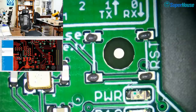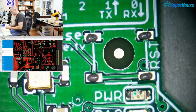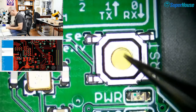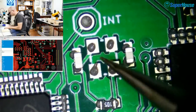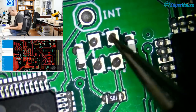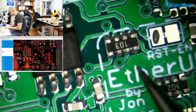I'm just going to grab a surface mount button out of my parts cabinet stuck on the wall over there and stick the reset switch on there. Okay, so this here that you can see, there's no crystal on there. That's because I don't actually have any 25 megahertz crystals in that footprint. So I'm going to bodge an HC49 US format crystal into that position.